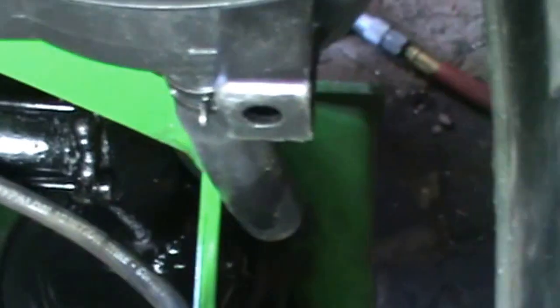And then on the return side it's right over there, so you just have to buy a quality piece of hose that's made for hydraulics. Try to show that. All that intake is just a weld on it all the way around, and then I just drilled through the weld, and that's what bolts up back to the carburetor with 3 10-32 screws.